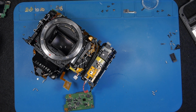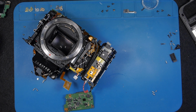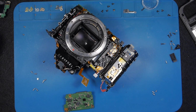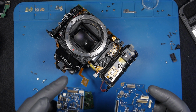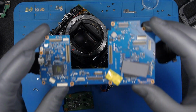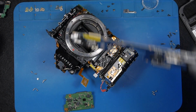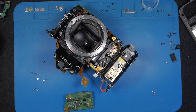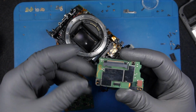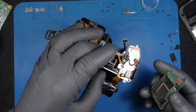It might be a loose screw that went into the motherboard, and that creates some damage. And definitely, since the camera manufacturers don't share any of their electronic schematics, it's very hard, not impossible, but very hard to find the issue on the motherboard. But before going to conclusions, let's change. I have another, not new, but fully working power board. I'll just replace it.